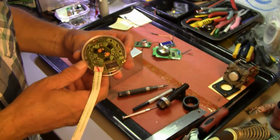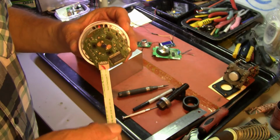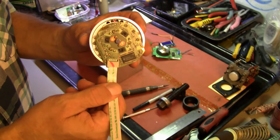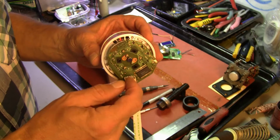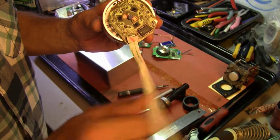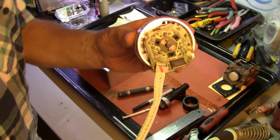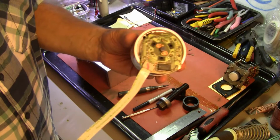Like the others, I believe that it gets 2 DC power supplies. One is the motor coil power supply. The other is the chip power supply. And a pulse width modulated drive. And with 6 pins, there's probably a couple of feedback signals going back down to the VCR electronics, now history, and or an enable pin coming up to start the motor spinning. This spins at 30 revolutions per second in its normal operation, so I know it's up to the job.